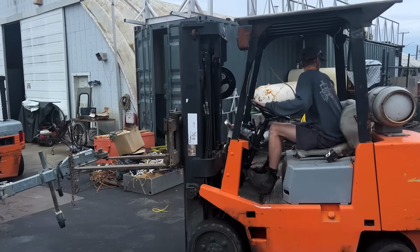We're just doing the final adjustments. This is a new machine here at JR Marine, so fine tuning is a must. Once again, Aiden had to account for springback as the material relaxes into position. This means slightly overbending each piece. For this machine, it's way easier to work in small increments, just to make sure you don't make a mistake.